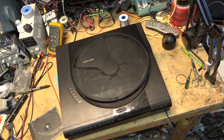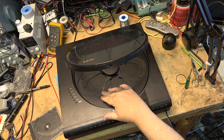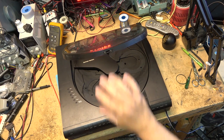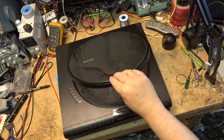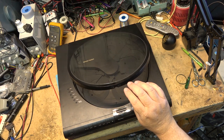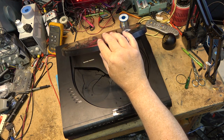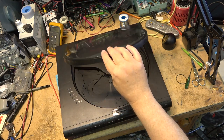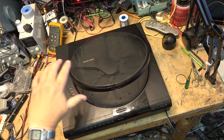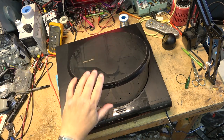Okay, it's got that same grease that dampens the lid opening. And then we can retrieve the disc and shut this one down. Yeah, if you move it too quick, it'll actually skip teeth. That will probably free up a bit once it's opened and closed a few times. This thing's obviously been sitting for an awful long time, and that silicone oil has really got gummy. But there, see, now it's opening a little quicker. That's a little more like it.